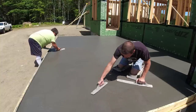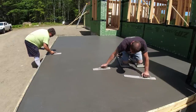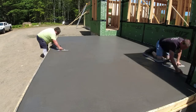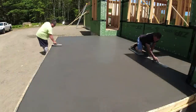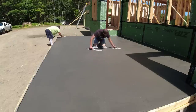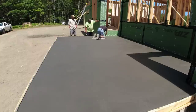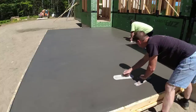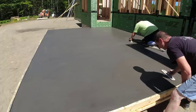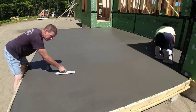This was about 30 minutes after the pour. The sun's coming around the building and it's starting to really beat down back here — really really warm — and we're just jumping right on it. I've got my skids on, I've got my two mag floats, one big one and one little one. I'm going to mag out the middle part; Eric's going to go around and reach what he can from the edge. We're just smoothing out the surface the best we can with our mag floats, getting out the bull float lines and filling in any little imperfections. Then we're going to jump off it and let it cure up for a few more minutes before we get on it with hand trowels. This has a little bit of air entrainment too because it will be exposed to some freezing and thawing, so we don't want to trap any air by sealing it off too early.